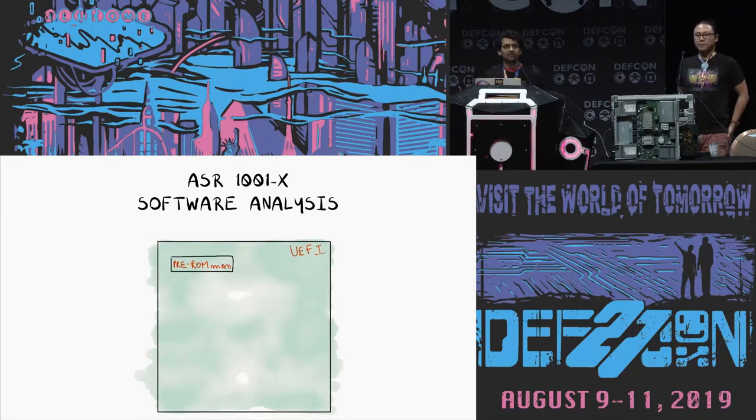So in the Linux kernel, if they want to apply a patch to the bootloader, the Linux kernel will update one of the SPI flashes, and then the pre-Rommon will validate whether it is right or not, and if it is not, then copy the code and copy again. Pretty common stuff.